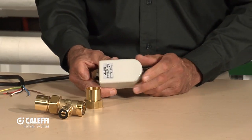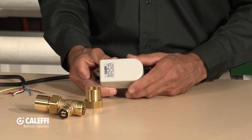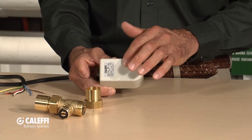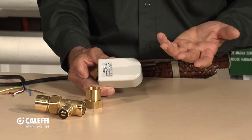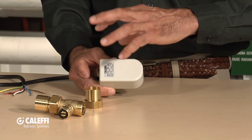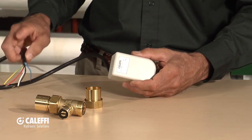The actuator can be used as an open and close — if you just want to use this as a two-way valve to turn the flow on and off, it can go open and closed. Or you could put a modulating control that would operate this actuator, like a Tekmar control for example. So this could modulate and be used to do mixed temperatures, very accurately, if you put a control that can drive this actuator to different ranges.